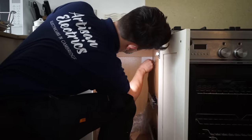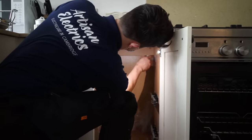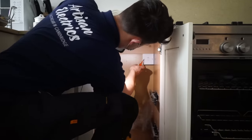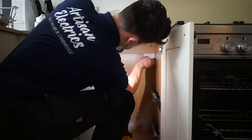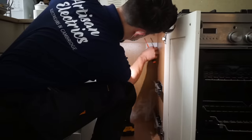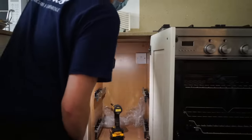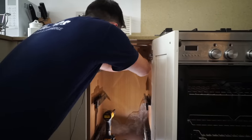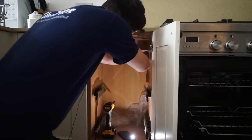So just to fill you in on the EICR, finding lots of little pieces that I don't like. This little isolation switch is on a 50 amp breaker, a C50 MCB, I think. I'm fairly sure that this isn't a 50 amp isolator. This is doing the oven, although I'm not fully convinced that this oven actually needs 50 amps. So what I suspect is behind here is probably a meaty old cable, like a 10 mil or something, if it's on a 50 amp. And then a little flex going out of it to the oven.